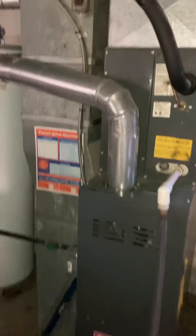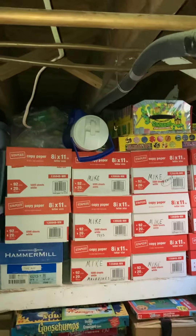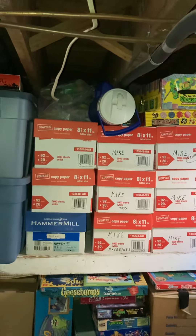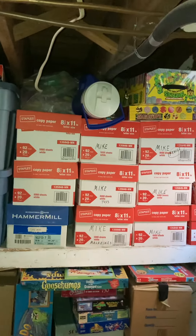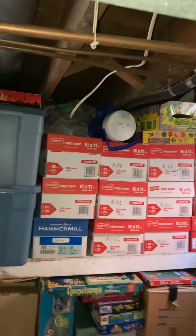The line set's sized right. It's making its way out through a joist bay. There is an addition on the back of the house — I can't follow it all the way, but it looks like it's going through the rim board, and I'm guessing the addition's on a crawl space. So we'll be able to reuse the line set since it's sized right — we'll flush it, pressure test, and recharge it with the new refrigerant.